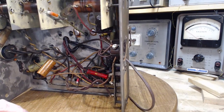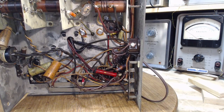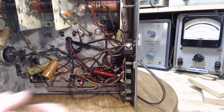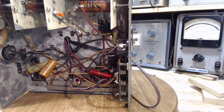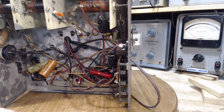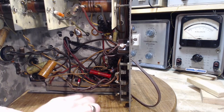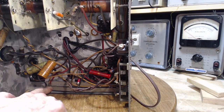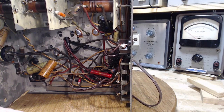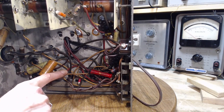I see two black wires heading down in there, unfortunately blocked by this big honking resistor. There's always a chance the radio designers are using spare terminals on a socket just as a terminal strip, which is very misleading when examining the circuit. There's a red wire here coming to the top of this big resistor, and a 450-volt capacitor with the positive lead tied to the same terminal — it all suggests high voltage.